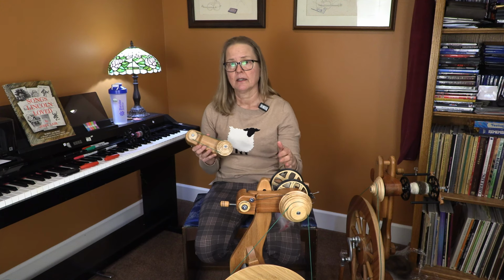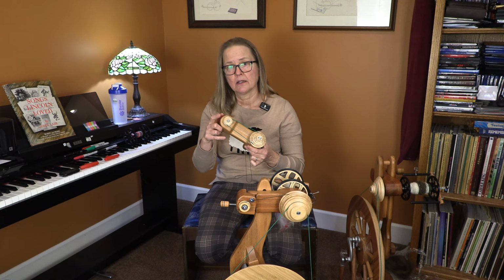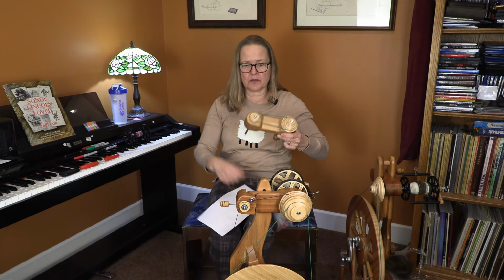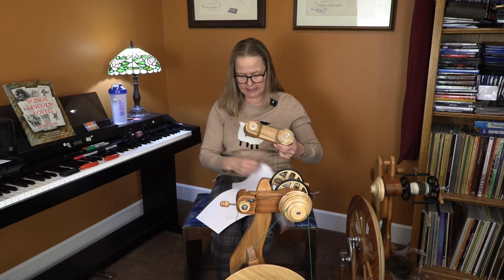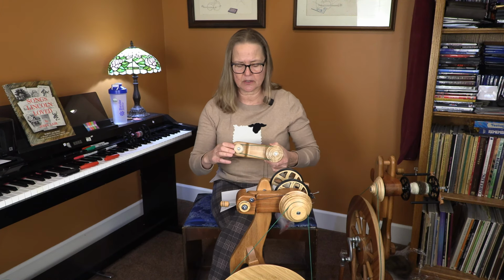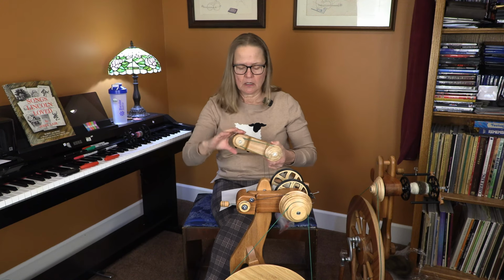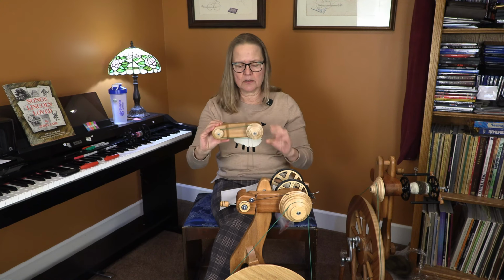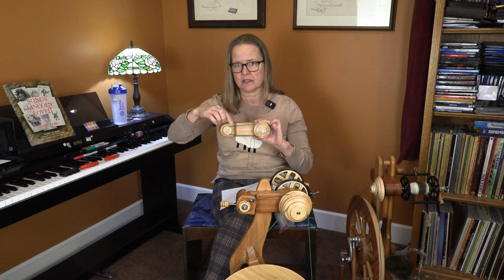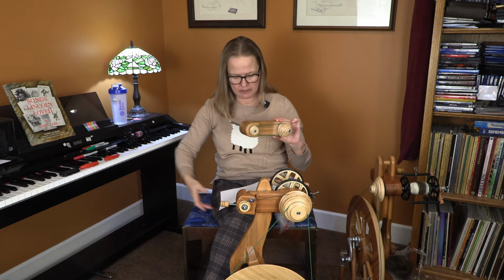And using that data, I still needed something else, because we have this 3rd pulley on the high-speed head, which is, like I said before, a multiplier. So I measured this 3rd pulley. They call it the idler. I was doing a little bit of research, and what I was reading was that the idler in physics is what you use to change the direction of your gears. Also, when you have more than 2 gears in a system, it's called a gear train. What that means is this gear affects this gear, this set of gears then has a value that affects this gear. So it's kind of like this multiplier, like I described it before.